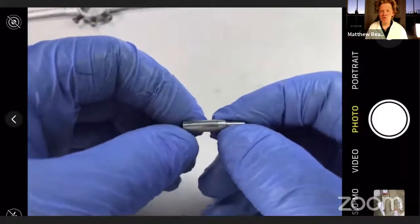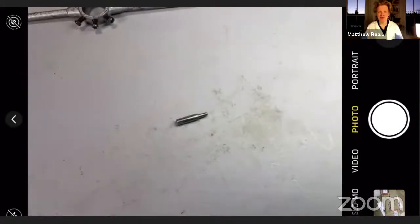So this is just EN1A. Now, I thought it had lead in it to make it free cutting, but it doesn't seem to from what I can see. It's got silicon in it and something else as well, which you might remember in a minute. So that's like mild steel, which is probably as close as we're going to get to whatever the pendulum rod is made out of. So I've got no problem there with strength, but I thought it's a good opportunity to talk about the other kinds of steel we're likely to come across that you might want to use in your clock repairs.